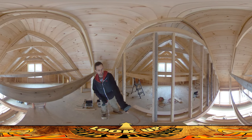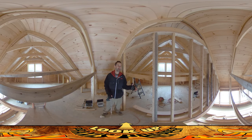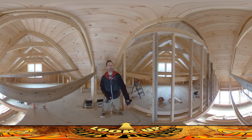You can see one wall board right along the bottom there, and there's another one that's getting set to cut. I'm going to be doing wall boards on one side of this wall to start, and then I'm going to be putting in the electrical boxes. Then I'll be able to access from the back to run all the wires through all these stud walls. That way it'll be a lot easier to do the wiring if I leave this side here open.